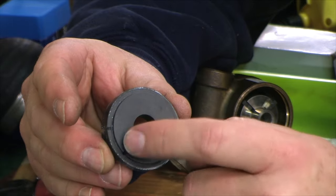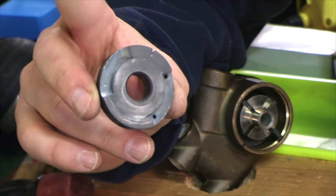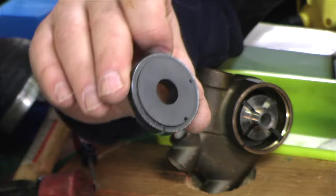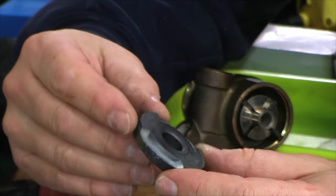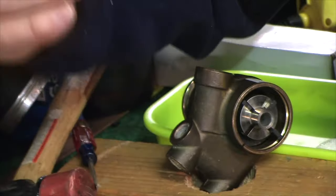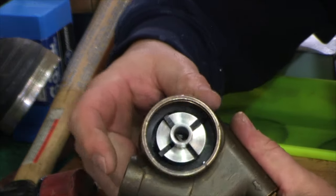This is the seal side toward the outer side of the pump, and that's the inside of the pump where the carbon vanes run. I think this is just a piece of carbon material that's high-pressure pressed into a form — really brittle. I'm surprised it didn't crack since I've already taken this out three times.